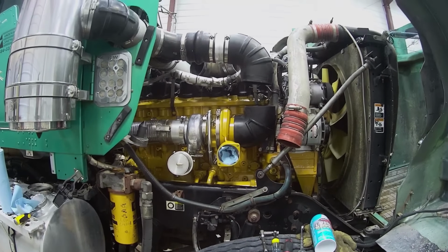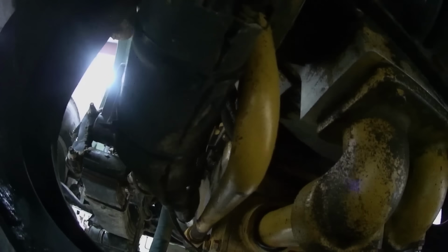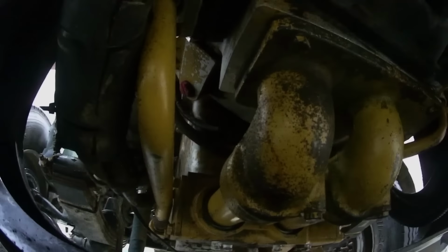Okay, I wanted to show you, this is the control valve for the retarder. And this has got a spool, big spool in there, and a diaphragm, and it runs off of air. And air is what actuates it. But I think most of our leaks were coming off of all these little places. Like right here, there was an O-ring into the pan. And this great big assembly here needed resealed. This tube. There's just a lot of stuff on here to leak.